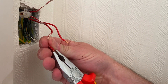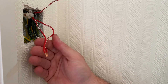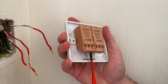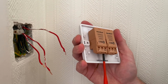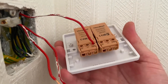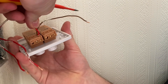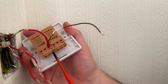My two switching lines are ready for their connections and they're better than what we had before — still plenty of length. That's the beauty of making sure you leave conductors a reasonable length the first time around. We've got our commons and our L1s; it's not a two-way dimmer so we'd have L2 if it were two-way. Let's drop the common in — got to try and get that bridging link going in there as well, doubled over — and then my connections go into common, bringing the permanent line into common and looping across to the other common.